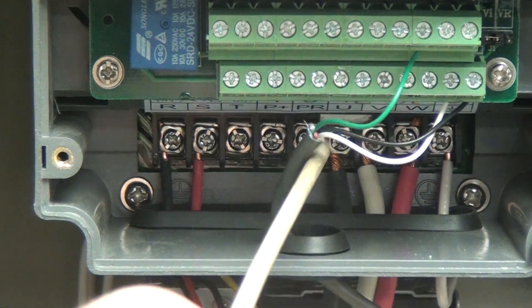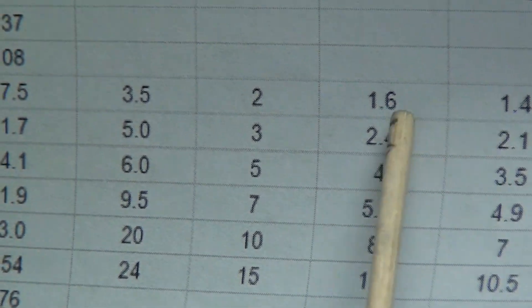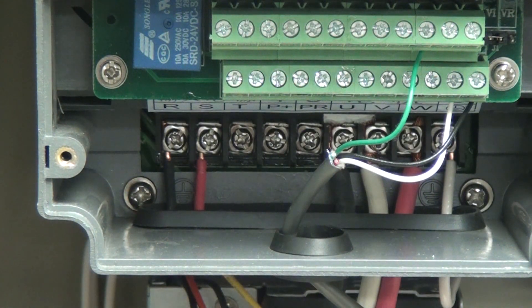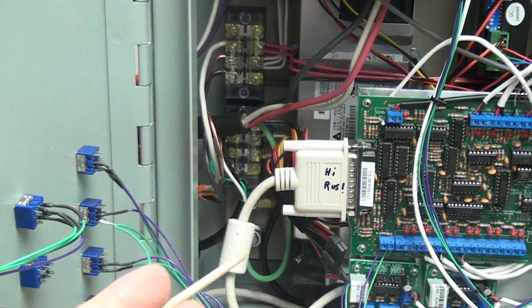These three larger wires — black, white, and red — are 12 gauge. The reason they're so big is that's just what the store had when I went to buy wire. According to the chart, you could probably run 18 gauge — that's 3.5 to 4 amps — though maybe 16 gauge would be a little safer. You really don't need large gauges, especially over short runs, to power a 3.5 amp 1 horsepower motor. Three phase motors are self-balancing so there's no neutral, which is why we just have three conductors. These are pins U, V, W. When you buy your wire, you still want to buy four conductor wire because the fourth conductor is the ground — there'll be a ground lug on your motor that ties into the chassis ground.